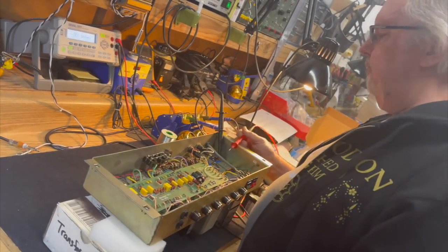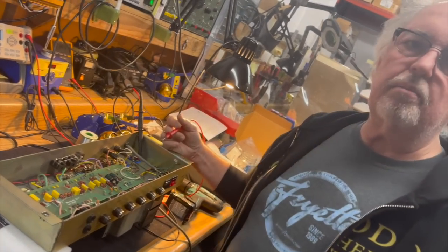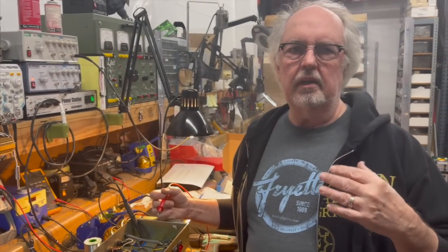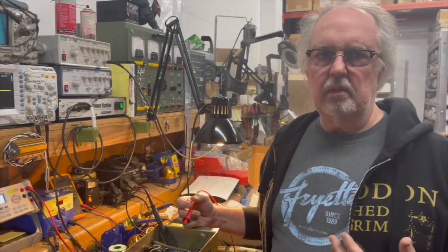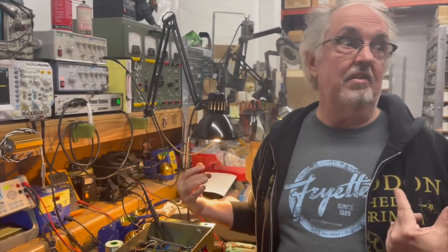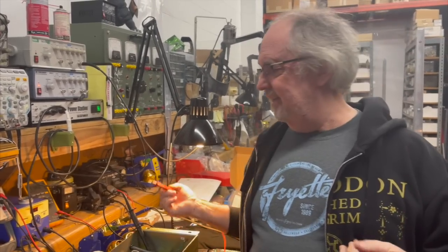So for a late 70s model, a 400 volt plate supply would be normal. They were lowering the plate supply to try to get more lifetime out of the tubes. And then the amps are getting weenier sounding, so they replace them with 6550s to try to compensate for that weeniness. Isn't that interesting? And then it gets more brittle, and, you know, it's like this, too.